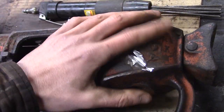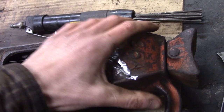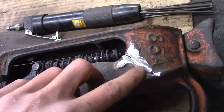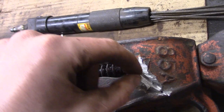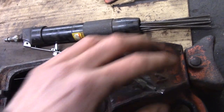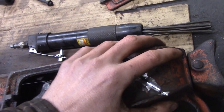So like I said, we'll get this on the welding bench, warm it up with a torch, not super hot, just nice and warm, maybe, I don't know, 200 degrees or something. We're going to weld it. Obviously just one pass is all I'm going to need, just buzz it right over and I'll be done. As it's cooling, I'm going to do two things. Firstly, I'm going to keep the torch on it lightly so it cools down even more slowly.